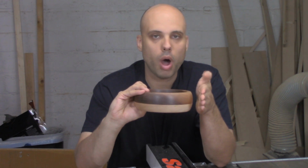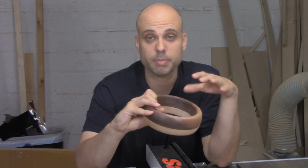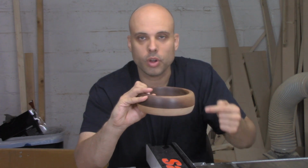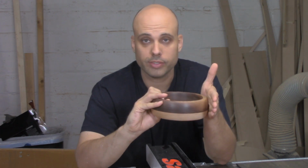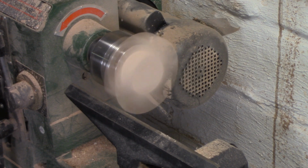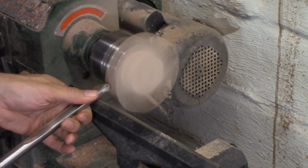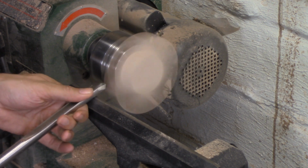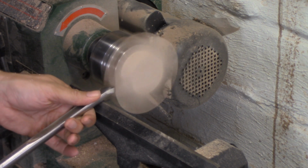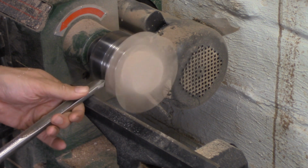So I'm also going to want a mounting plate that can glue to this and then be screwed into the wall and keep everything sturdy and secure. I'd like that plate to be kind of low profile, just sort of an oval of wood behind the stand. And what I think I'm going to do for that is cut some rectangles of maple, and then, this is kind of an experiment, I'm going to take them over to the lathe, and I'm going to try and turn just the narrow ends of the rectangle into a nice circular shape and maybe put a little bead detail on them. I know that's not going to work perfectly.